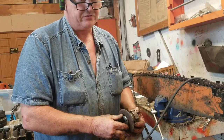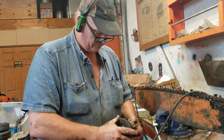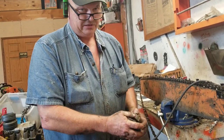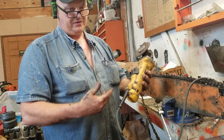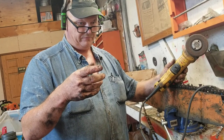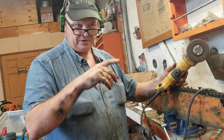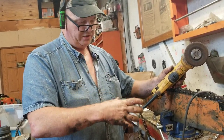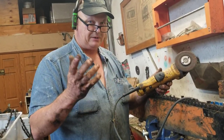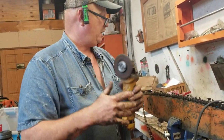I've gotten really good at this and I just go ahead and sharpen them. I'll carry one chain. North Carolina Timber Slasher was talking about wanting to learn to do this. You don't even take it off - I just carry the thing with me. You can plug your charger into your inverter. If you've got a 12-volt system, just plug it into a cigarette lighter. If you've got a 24-volt, you'll need an inverter to change it from 24 to 12. Then you can bring your battery pack charger behind the seat, have a spare battery, or take your battery off and charge it - you have a charged battery all the time.